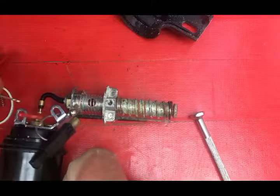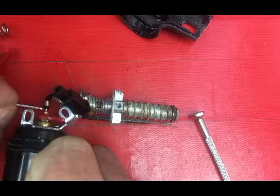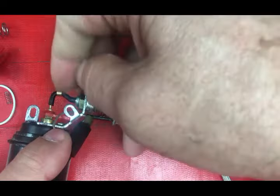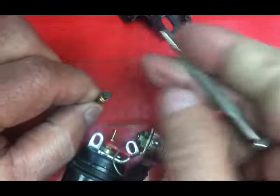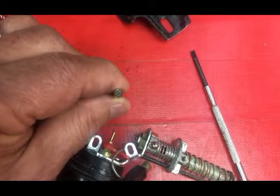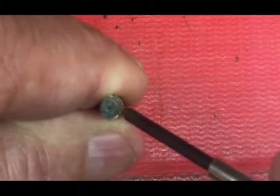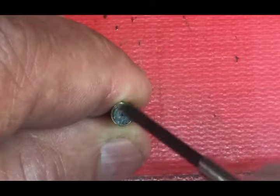Let's take the back case off so we can see the mechanism more clearly. This little valve was installed in the system and it pulls up on this lever, and that's what lets the gas from the chamber back out through this little nozzle. That nozzle is the thing that gets plugged. We pull this little wire off, pull this lock back, and this will come out. This is the nozzle that is plugged really badly. If you've overheated the torch, it'll get burned up and you won't be able to fix it. If you haven't overheated it, this will be nice and shiny and you'll be able to see those holes. There are a bunch of little bitty holes in here that get plugged up, and you can soak this in denatured alcohol.